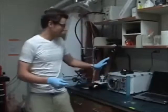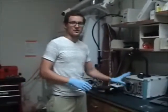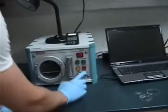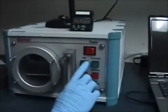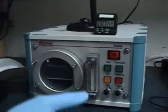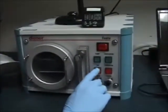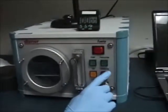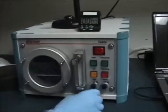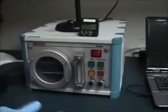We want to use our plasma treater chamber, so here's a quick walkthrough of all the different buttons and what they do. Right here is the power. Then we have these two buttons: pump and ventilation, which pressurize the chamber and keep the door on — you pump the air out and push oxygen in. Then we have gas, the button to actually pump oxygen into the chamber. Then generator, which actually does the plasma bonding. We can fine tune things with the timer and power — right now both are set at 50 and 50, but you can change them depending on what you're bonding and your specific protocol.